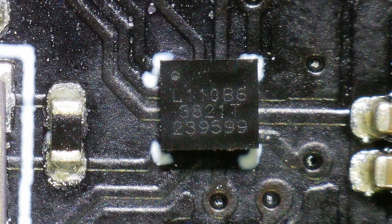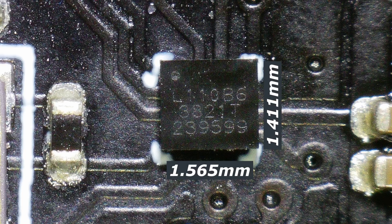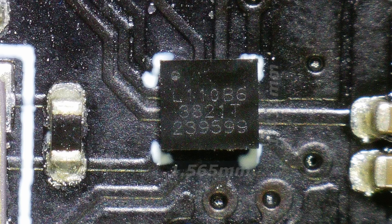Just to reiterate how small this chip is: it measures in at just 1.565 x 1.411mm and comes in a CSP16 package, which is a BGA chip with a 0.35mm pitch. The distances between the solder balls in this BGA are quite tight, and you should check with your PCB manufacturer to see if they can support these tolerances. In terms of documentation, there isn't an English datasheet yet, but I've run the Chinese version through Google Translate and I'll link that below in the description. Some of the translation is a little rough.